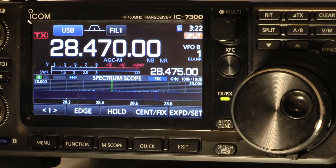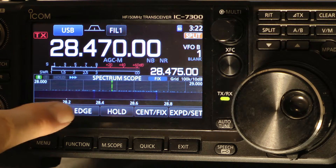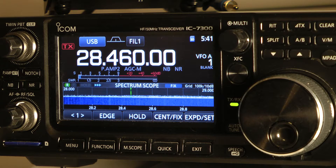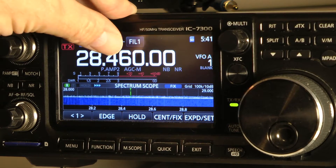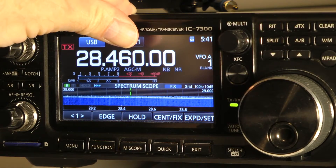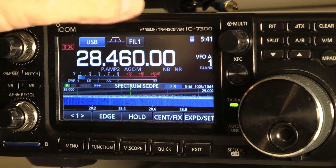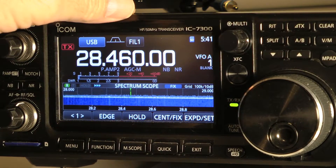And if I hit my microphone, when I key it up it says it goes to 475. Wasn't that easy? The second way is also really easy — you're wanting to receive on 460 and you want to transmit where he's listening on 465.